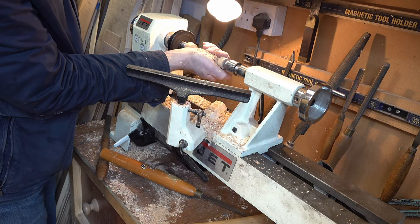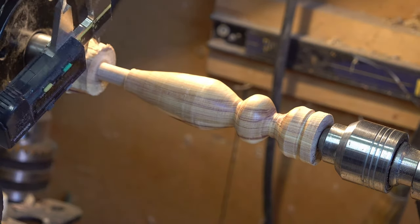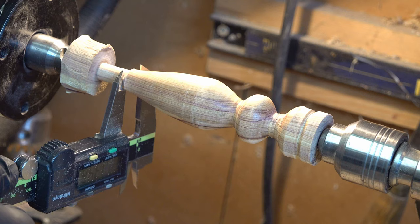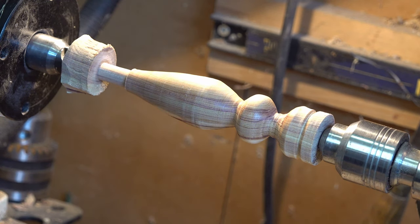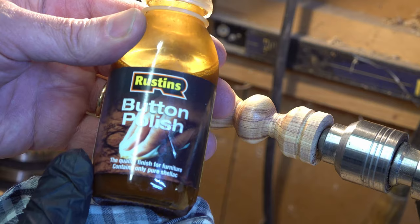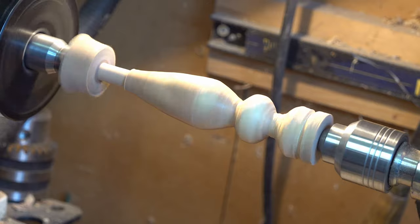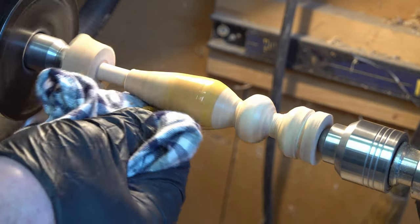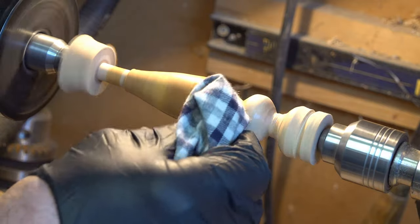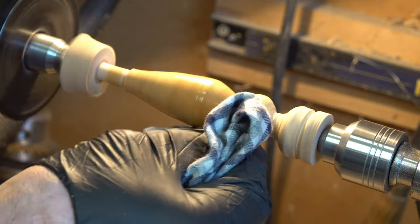I'm just using a bit of the wood chippings to give this a bit of a polish. I've done a quick measurement and confirmed I've got this to a very slight taper on an interference fit, so that should be okay. I'm going to put a bit of button polish on here — provided one keeps the hand rest well away and the rag short, I quite like doing it on the lathe, but you do need to apply it from underneath and make sure it doesn't get caught.